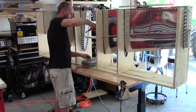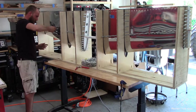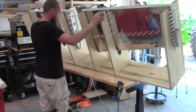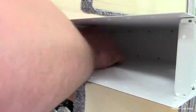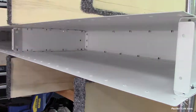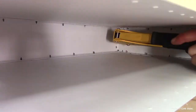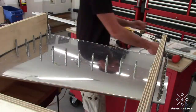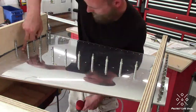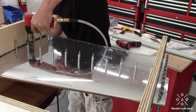What you're seeing here is we've placed the forward spar assembly into the horizontal stabilizer assembly and we're doing blind rivets from that middle rib into the nose rib through that front spar assembly. I do have one of the Milwaukee cordless blind rivet tools and it would not fit in there, so I did have to use the manual rivet tool. Out of curiosity, I used my inspection scope to check the backside of those blind rivets since I've never really paid much attention to them. The process repeats on the other side — I tried to keep myself balanced and do the same operations on the left and right side at the same time. After doing those blind rivets, you move on to riveting the middle rib and the front spar assembly.